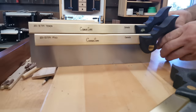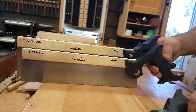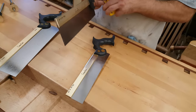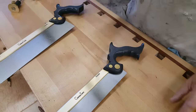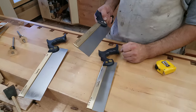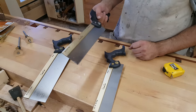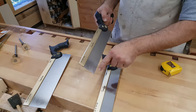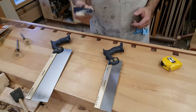There's the tenon saw on the back, the medium tenon saw, and there's my dovetail saw. Now, the characteristics of this saw: you have a depth of cut that's two inches, the blade is 11 inches long, same 25 thousandths thick steel — it's just a little beefier cut. The brass back is 15/16ths, as opposed to one inch wide, by a quarter of an inch. We have 22 teeth per inch at the starter strip, followed by the same tooth count — 12 teeth per inch — for your main cutting.